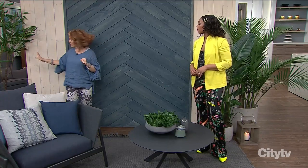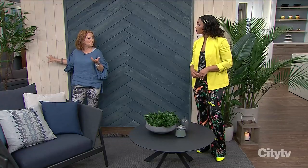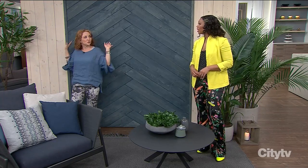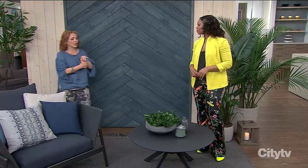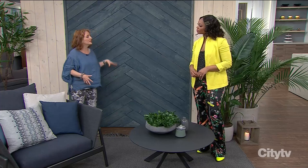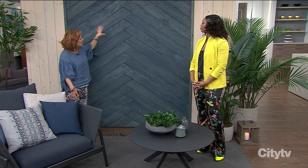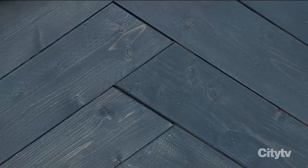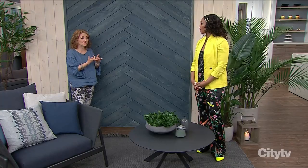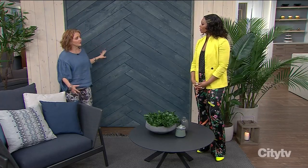The rest of the perimeter is a silver gray — this is a translucent stain, so it keeps everything fairly neutral. It's probably what the natural color of the white cedar is going to turn to anyway, so it's not going to be a lot of maintenance for that back area. But for this feature point — in your dining or lounge area — you can change this. I used a semi-solid stain, Arbor Coat, in a color called Blue Note. We do have colors in semi-transparent and semi-solid stains. With semi-solid you get a little more color but still see the beautiful texture of the wood.